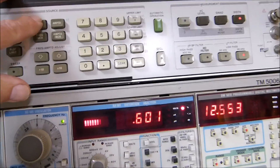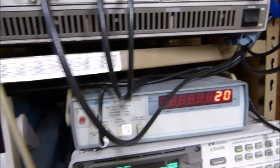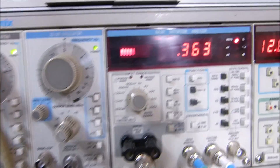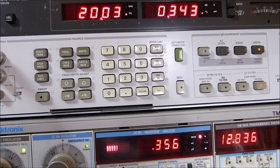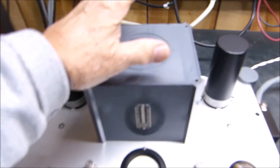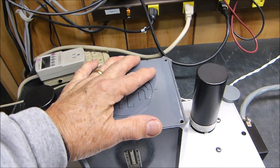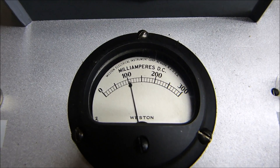Now at 20 hertz - there's our 20 watts and there's what it looks like. THD is 0.34 to 0.35% - pretty good for an amplifier design from probably the early 40s or even late 30s. That is a massive transformer. Maximum power is about 1% THD at 25 watts. You can actually see the 20Hz making the meter needle vibrate.